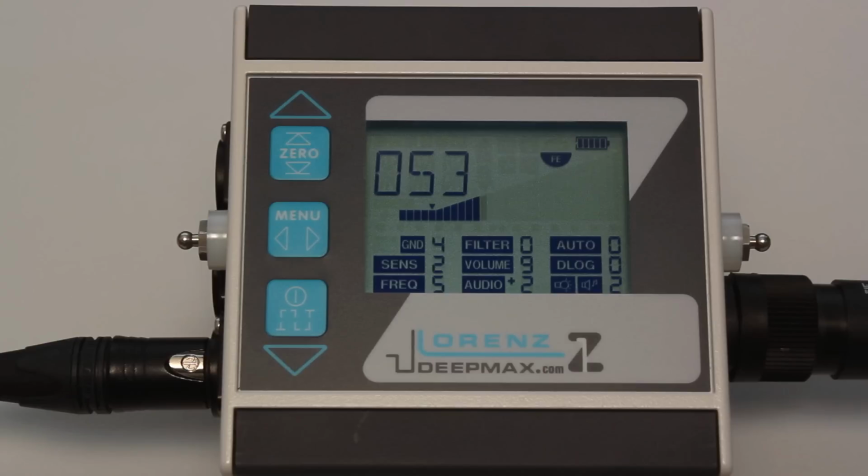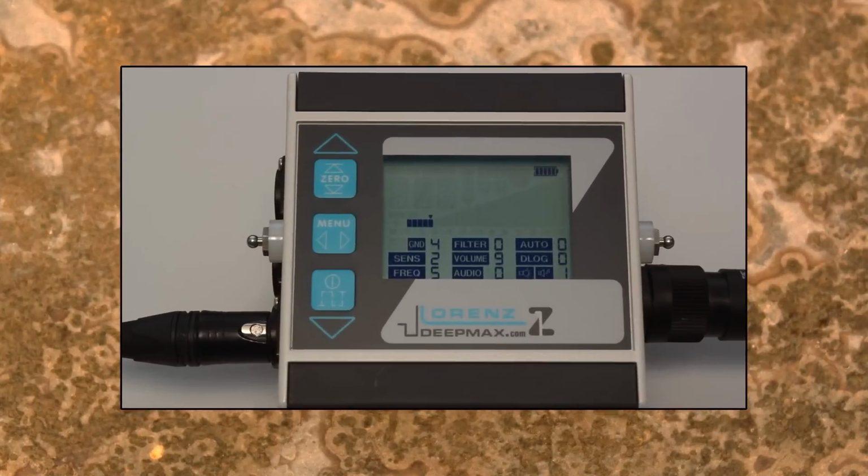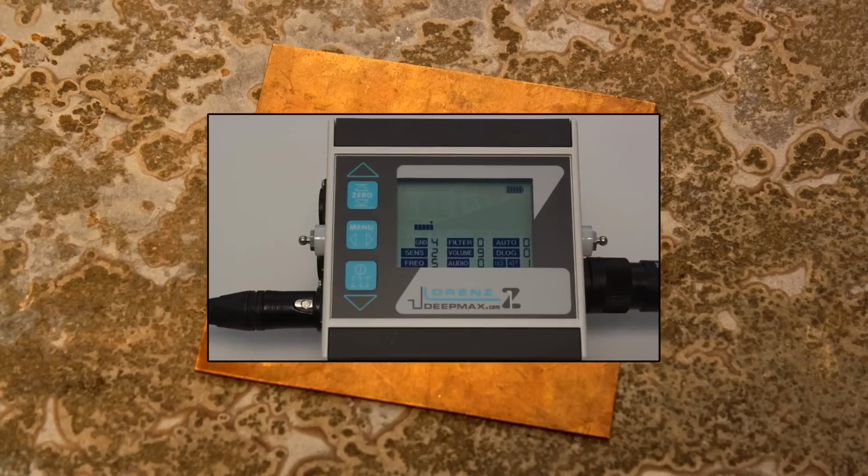In some cases, however, large ferrous metal objects will give a non-ferrous indication, but can still easily be identified as being ferrous because of the number derived from the eddy currents. Metal objects with a very long duration of the eddy currents, for example larger copper, silver or brass plates, will lead to a very high time delay reading and a non-ferrous indication.